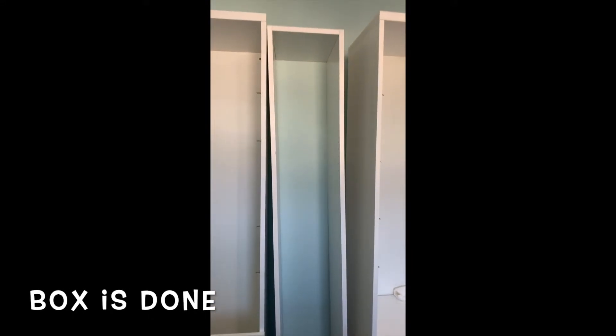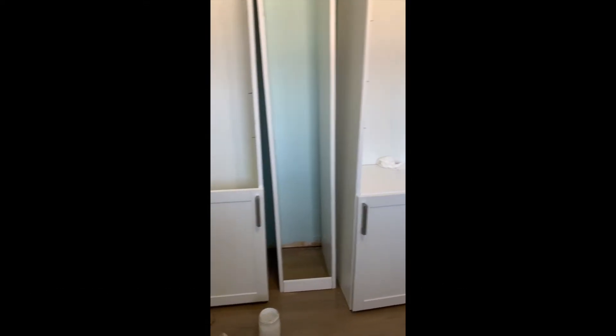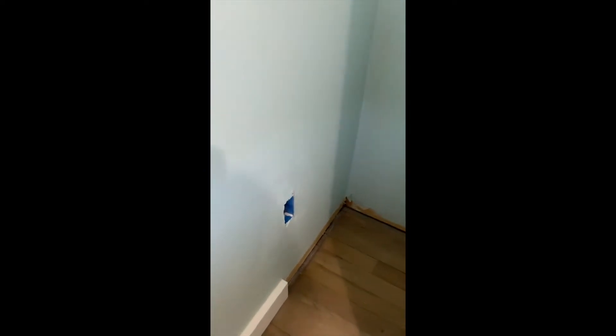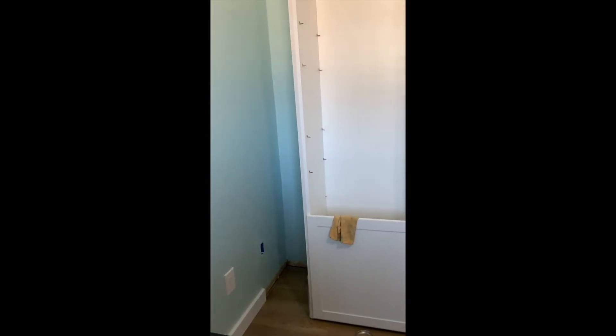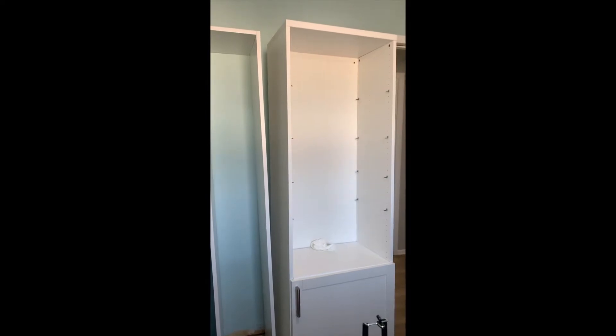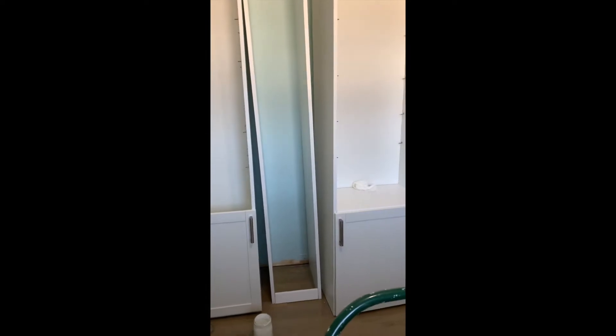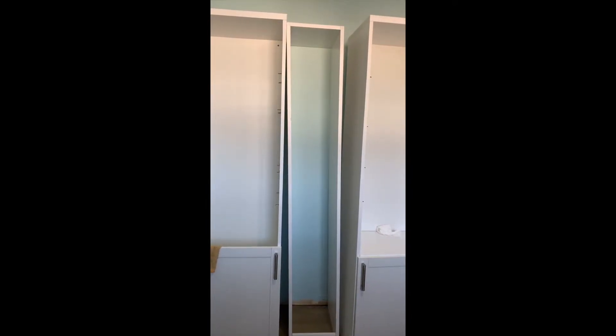This is the preliminary — I put a 2x4 there to hold it together. It's not going to go anywhere because it's going to be sandwiched between these two, so I'm not too concerned. I had a little space between this point and the cabinet so I put in some shims and it worked really quite nicely. I caulked it a little bit and now I'm going to paint it so you don't see it. Once I do that, I can put the cabinet against the wall and apply the shelves to hold it sturdy. I may also put a screw on top anchoring all three pieces together.